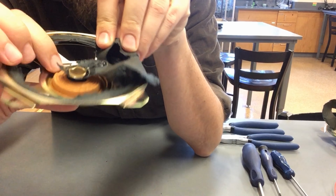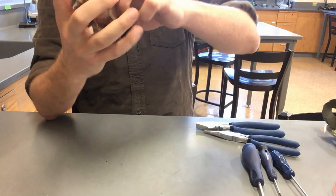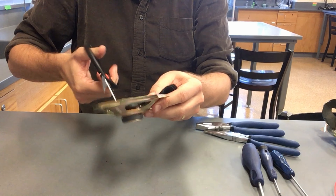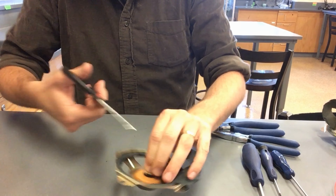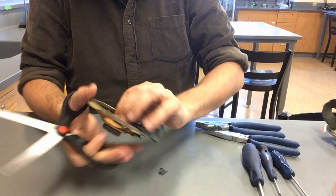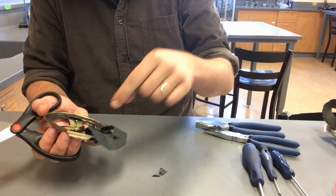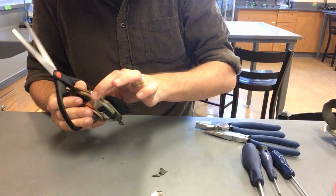There's the little piece of foil. Underneath that piece of foil, I see almost a second membrane that I'm going to call a spider. It's a tan-colored membrane, and it surrounds something right at the center of the primary membrane. So I'll remove these things a little bit further, cut through those wires that were coming into the center here, and now I'm going to remove this spider — the tan-colored piece.